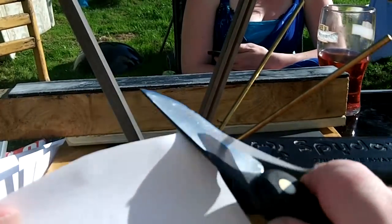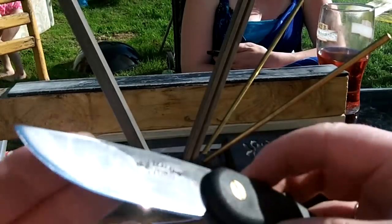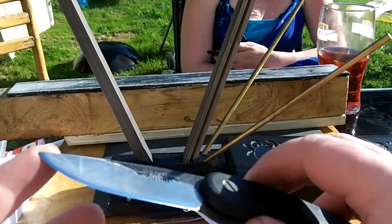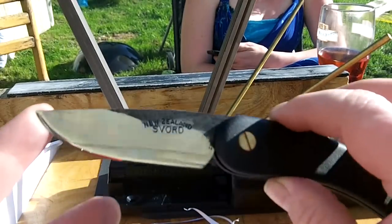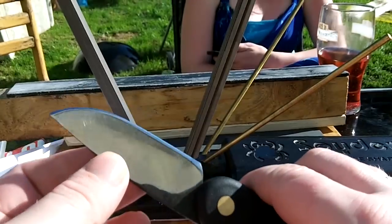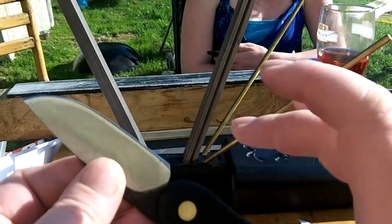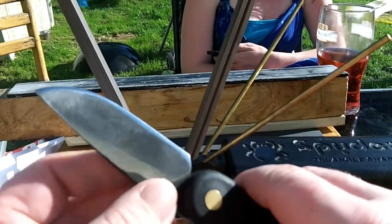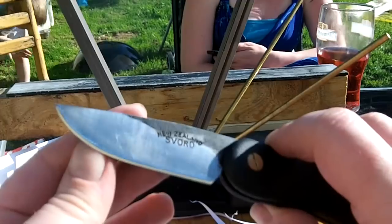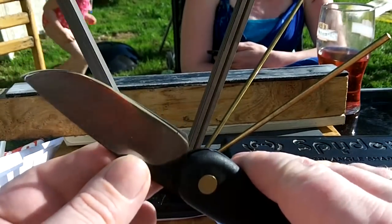Just to finish up the hillbilly sharpening video — I know a lot of people get into Japanese and Chinese sharpening stones; I have a few for doing straight razors. I'm not sure the actual grit type matters that much — the size changes, but the shape of the grit matters. Silicon carbide versus diamond: diamonds leave flatter, sharper shapes and deeper grooves that need more polishing out. A Belgian coticule for straight razors has a dodecahedron-type shape — very rounded — so it doesn't leave very sharp scratch marks and is very easy to polish up on the strop. But the end result, once you work through the grits to the finest and then onto the leather strop, you will end up with a very, very sharp razor edge. And that's good enough for me. Thank you very much.